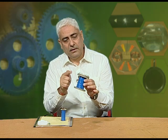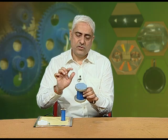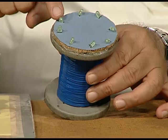So the basic principle is: first we supply AC source to the primary coil. We have a soft iron core which will enhance and increase the magnetic flux. This is the secondary coil — although there is no direct connection between primary and secondary, even then the magnetic field developed due to current flow in the primary will be linked to the secondary, and as a result an induced EMF will be created, which will be shown by the glowing LEDs.